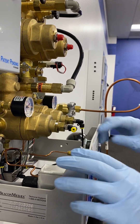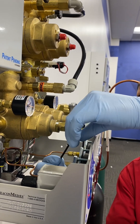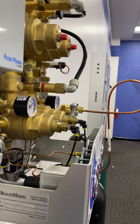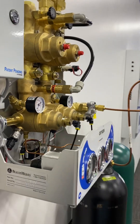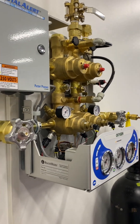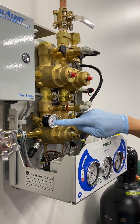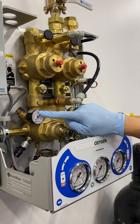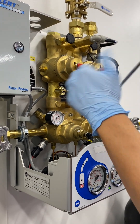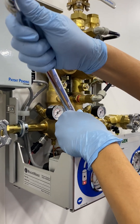Now we've got to connect our dome bias tubing. Tubing connected. Now we'll do our adjustment — to adjust this regulator, we're going to open our main line valve, put pressure on the regulator, verify that we've got close to the right pressure on the output, then put the regulator on line and make final adjustments by adjusting the adjustment stem.